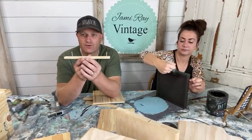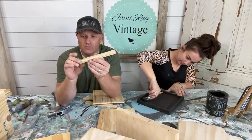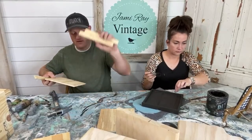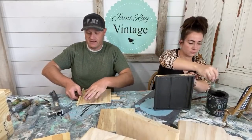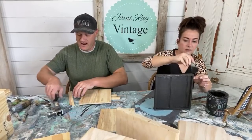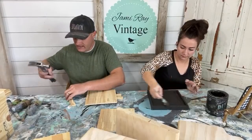A little trick when nailing something like this — it's going to get loud for a minute. What I'm doing is marking where my board is, so I've got my two pieces here as my depth measurement to get the double-sided or hanging effect. I marked where this is going to go and now I'm starting my nail first so I'm not up here trying to bang it and fight it.